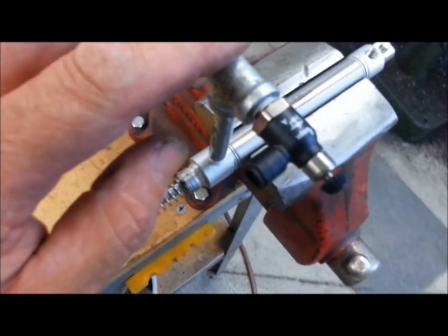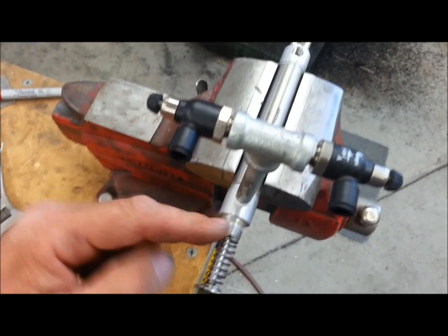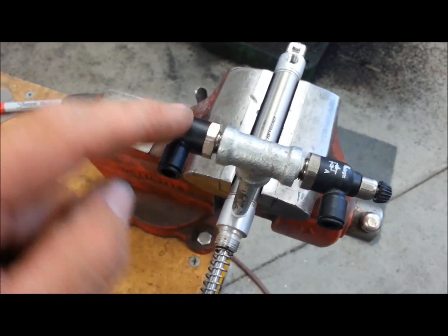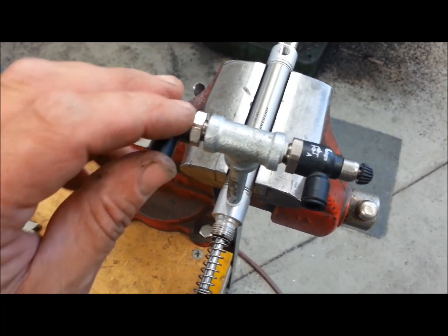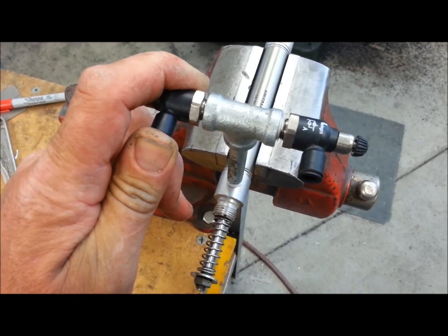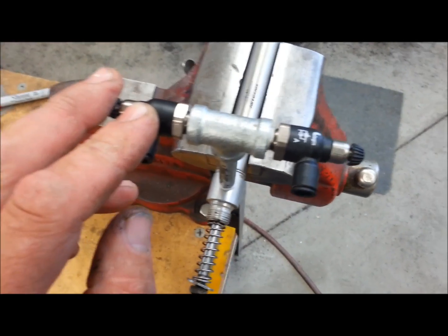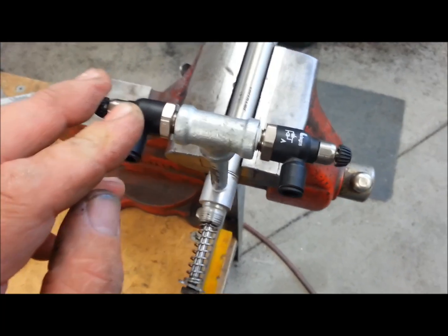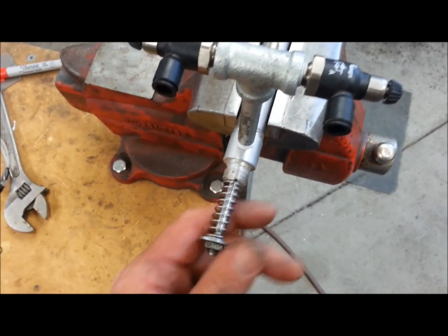That's usually inconsequential to air cylinder and air motor operations. When this line is charged and the cylinder is retracted or extended, you're sending a small amount of air to your motor, cylinder, whatever. Air cylinders and air motors don't care about that — all they care about is a pressure differential. You've got more pressure coming in one line than the other; that's how they work. So a small amount of bleed-through is acceptable, as long as the system in a neutral position — when you're not pressing a button — isn't sitting there leaking air all over the place. The only time this bleeds back is when you're pushing the button. So this is a perfectly acceptable fix for that logic.